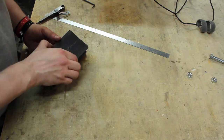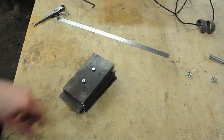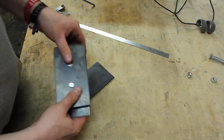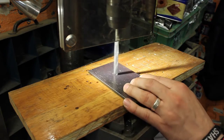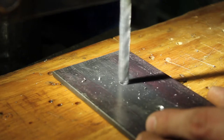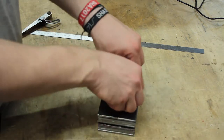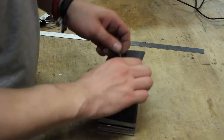The screws don't seem to be long enough, but I believe they are — first of all, they aren't countersunk here yet, and secondly there are giant margins between these pieces because of the burrs that I haven't taken off yet. So let's deburr them and see whether they fit even better. That looks much better — that fits really nicely together. Now I need to sink this outer piece a bit further. There it is, through the power of video editing. Now it's flush.